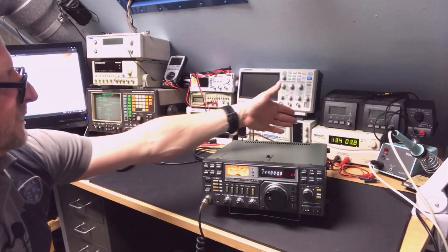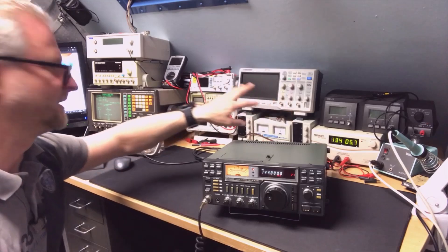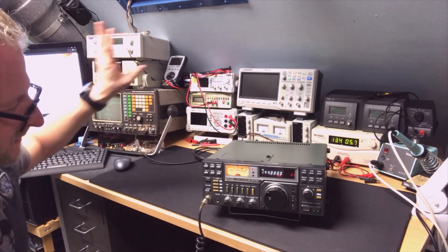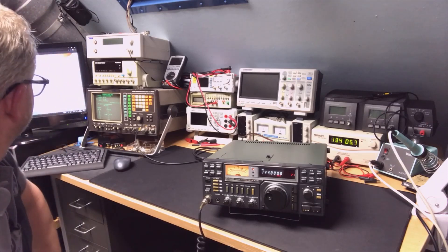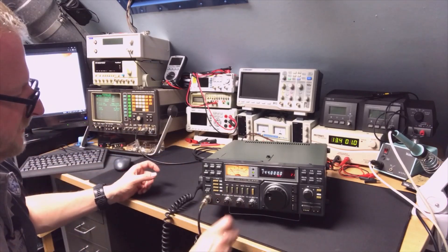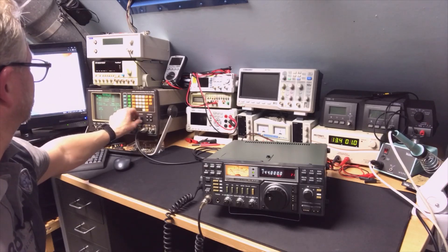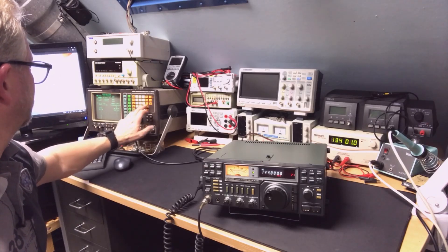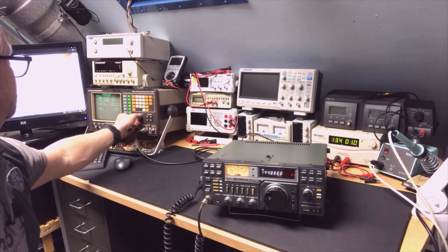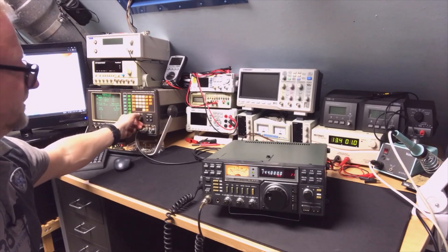We transmit — a little bit more power — and let's see if we put it on full power: almost 6 amps, and on the Marconi it says 24 watts at 143.99975 MHz, so that is good enough. Now let's do a receiving test: RX, squelch off, RF gain full. It's reading 0.5, which is minus 113 dBm.